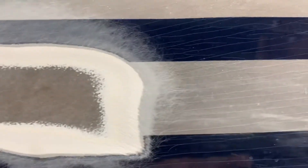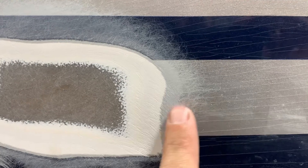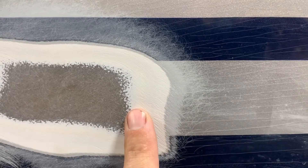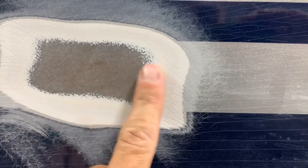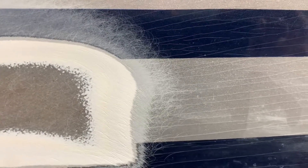We had a pretty large area down here that had some spider cracking in it — as you can see, it runs about six feet. Really concerning to look at, but like I said we found nothing inside. As you pick a spot to sand and grind, you can see there are lots of cracks in the first layer of paint. This is actually an old silver they had on it. The cracks kind of disappear at the gel coat, then you get down to the glass and there are no cracks in the glass. All these cracks are just in the two layers of paint job they put on the boat.